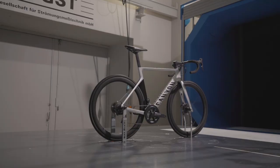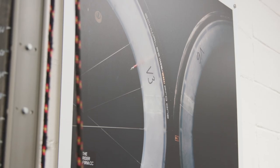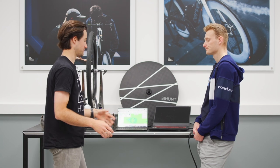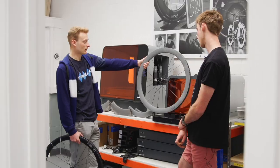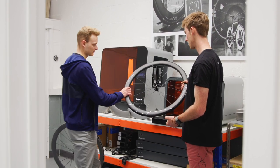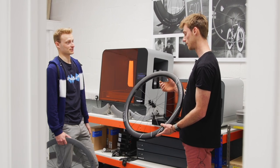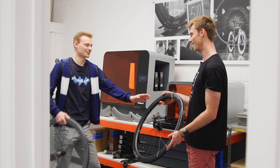You always want to validate this in the wind tunnel. We'll always take our final profiles to the wind tunnel, and that's where we can get the real-world drag data. We're using CFD predominantly to rank profiles — we're not trying to get real-world results from it. To get real drag figures and compare against competitors, the wind tunnel will always be the gold standard of an aero test. After all that design work, we end up with something that looks a bit like this — this is the Limitless wheel, something that I've ridden, and I never knew the amount of work that went into it.